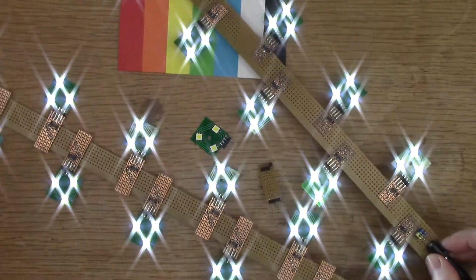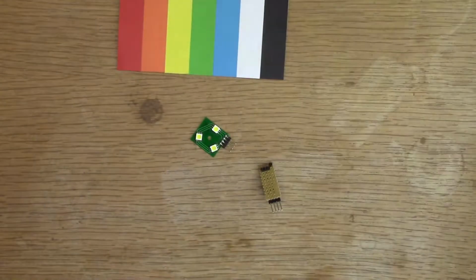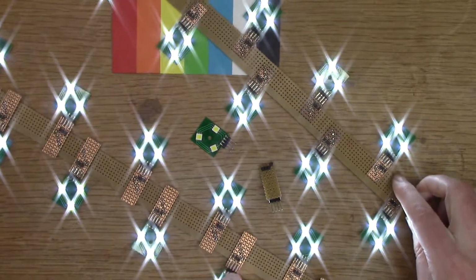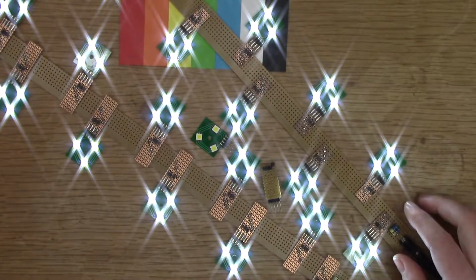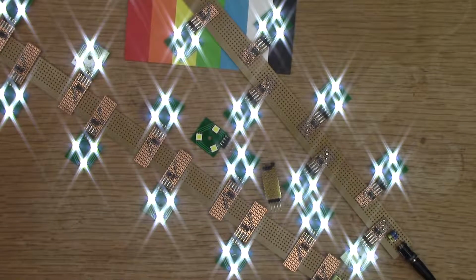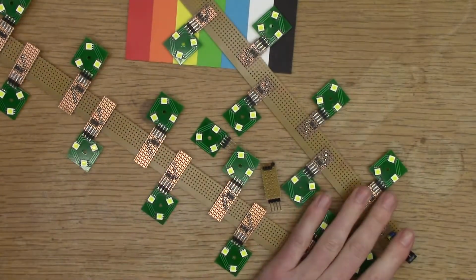So the light output of these two strips is about 900 lumens. It's kind of hard to see with my other overhead lighting. It worked okay. The only problem is that I grew to dislike the blue color. These are 5500 to 6000 Kelvin lights, and what I had shown last week was a 4000 lamp that I have here, and I overall prefer that.